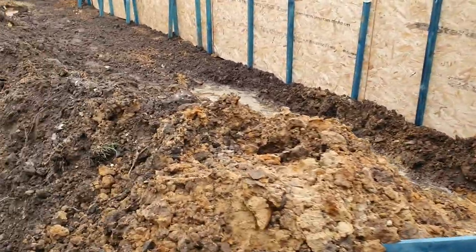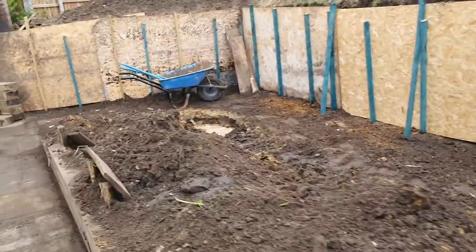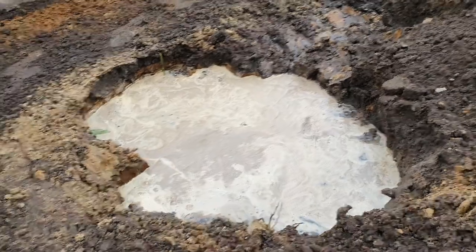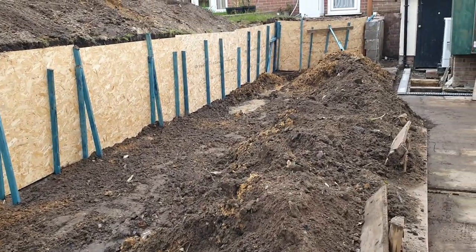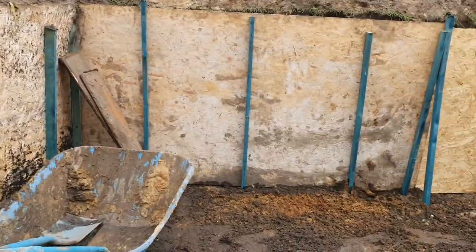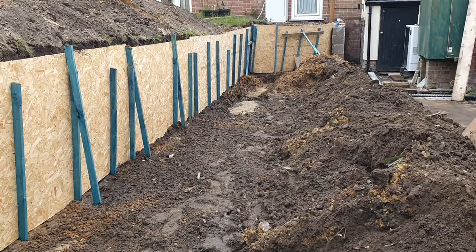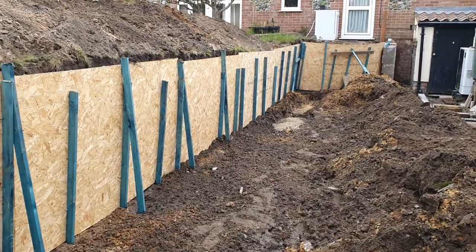So what we're going to do is dig out and do it stage by stage — as soon as we dig it out, we're going to backfill it straight away with concrete. Because a lot of the time we're digging it out and it's filling straight up. We've dug a hole here just to keep an eye on the water line and see where it goes down over time. Within the next couple of weeks we'll come straight back and start putting concrete in. This is going to be a retaining wall with steel rebars going in it, hollow concrete blocks, and it's going to have double concrete blocks on the bottom going up to at least six or seven bricks high. That's going to take quite a bit of weight, so that's why we're putting those steel bars in there.